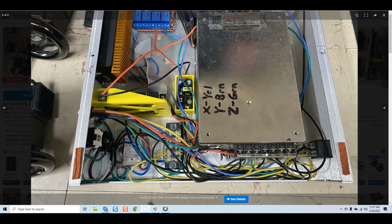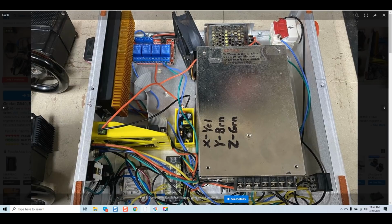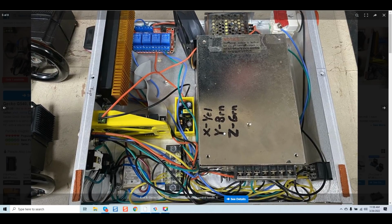And as we come over here, once again, we see the power supply and multiple leads going to terminals. I mean, this is scary, guys. It's really frightening. And I'm telling you right now, the Ethernet Smooth Stepper is literally one of the most stable controllers out. However, and you can contact Warp 9 about this if you don't believe me, most of the issues that are caused by symptoms like this, where guys will say, oh, I'm getting random issues with the system, well, if you install a 5-volt power supply that's powering this ESS, and we're in this proximity in here, and all this other stuff is going on inside here, and all that EMI is trapped in here because, again, this power supply radiates EMI, and then this power supply here, plus I'm believing this is a buck converter of some sort. I'm guessing. I don't know. But let's just give him the benefit of the doubt and say it is.